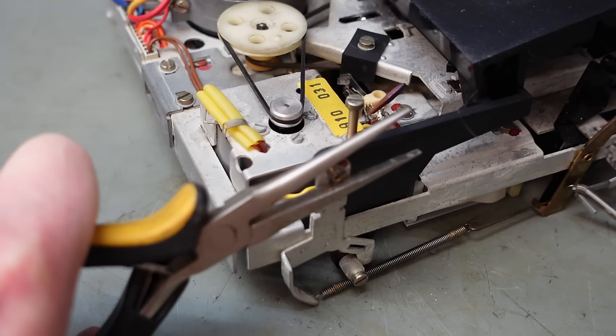We'll try that torque tape in there again. Careful I don't push this in too far because the capstans aren't running. Yeah, seems to be working okay. We'll power it on. Now the capstans are running. Simultaneously, start the motor and push this forward. Well, it's doing the same thing. I'm suspicious that it's actually the torque tape with its spring-loaded spools sort of causing trouble here. It's not what I expected.